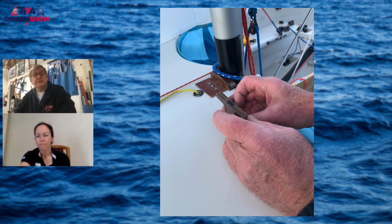So with Simon inside the boat, I don't have any chocks at all. The kicker is going to be slack. But what happens is the mast is going to be as bent as it can be in those conditions. As soon as it gets up, so that Simon's the right weight, I bung in all the chocks so the mast is stiff so that we can really go. Then there comes a time when I'm having to spill, so I go back to taking the 10 mm chocks out. So in light winds, have a gap so the mast can find its own position so the air can get over the leading edge of the sail plan. In middle conditions, nice and stiff.